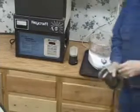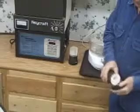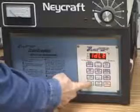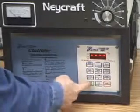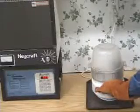After removing the masking tape and the rubber sprue formers, the flasks are steam de-waxed for about 45 minutes. The controller on this oven is being programmed for a 12-hour burnout, and after reaching 300 degrees, the flasks are transferred from the steam de-waxer to the oven.